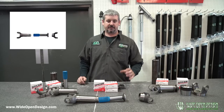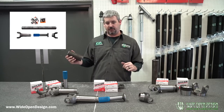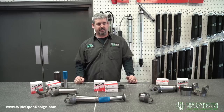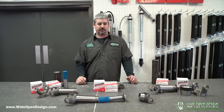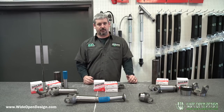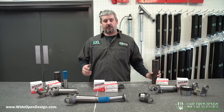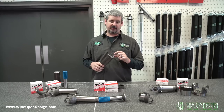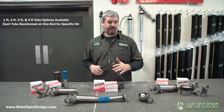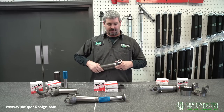When you come in to your basic kit, you can always add options. Your options are going to be u-joints and u-bolts, or tubing and the length of tubing. One thing we're addressing in this video: we're getting a lot of guys ordering really long lengths of tubing, and we get the feeling they're trying to make two driveshaft kits work with one piece of tubing — but it doesn't work that way, because when you order the kit, the driveshaft tubing comes machined to fit that specific kit and they're not interchangeable.